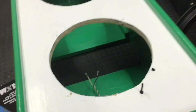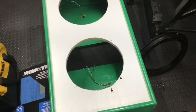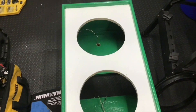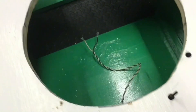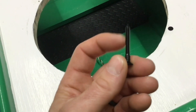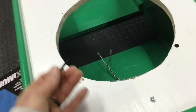I had to give the speaker holes a small trim because they were cut at exactly 11 inches for a 12 inch speaker. You kind of need 11 and a quarter inches to compensate for the bevel on the back of a speaker. They were fitting a little snug so I widened them up. This is the mounting system I'm using — it's the old Fender style, a double-tier screw. This is the part the speaker nut screws onto, and then this screws into the wood, so they go in this way and the speaker mounts from the rear.